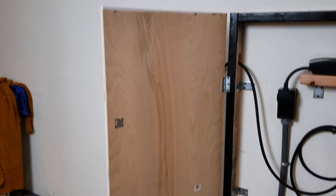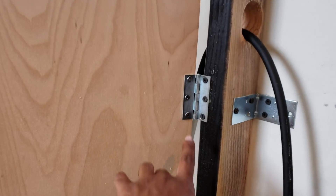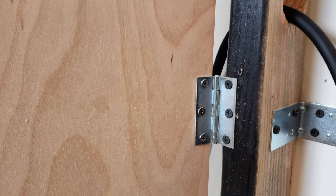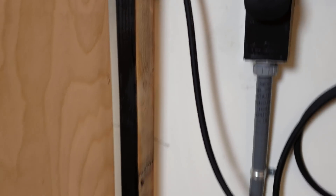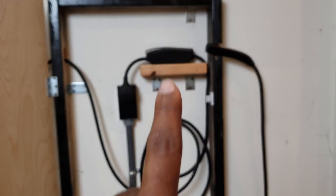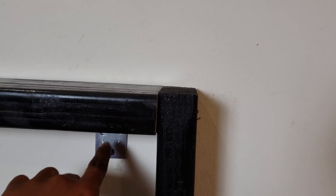The actual door is a four by two piece of three-quarter inch plywood. I grabbed some hinges — one at the top and one at the bottom — and connected them to the 2x4s. I connected the 2x4s together using L-brackets: two L-brackets on one side, two on the other side, and one at the top since it held. These are also screwed in from the other side.